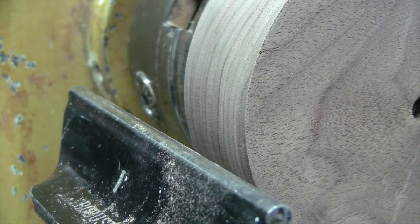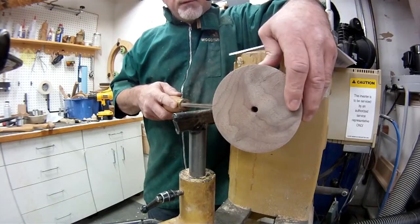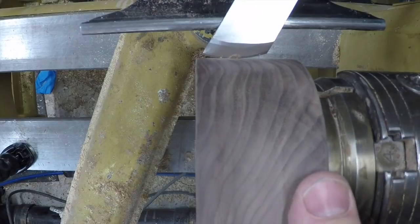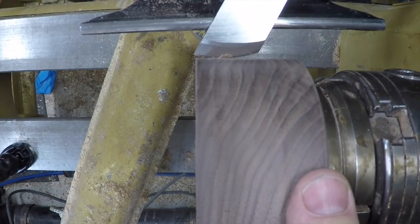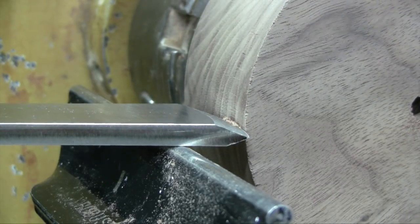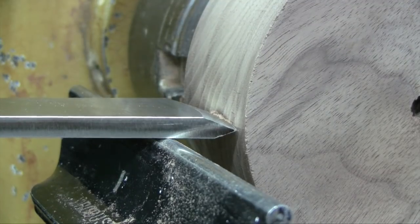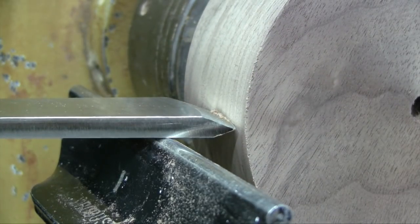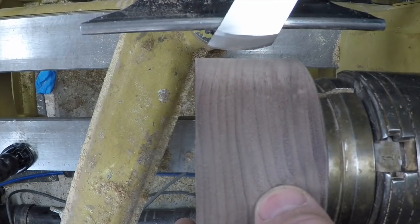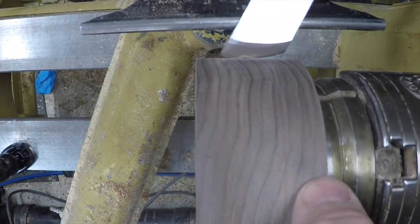Now with a negative rake scraper, for some reason, there's very little energy transferred to the tool. I'm not exactly certain why. I think it has something to do with the negative rake on the top. The direction of the energy being transferred simply doesn't come down on the tool. It may also have to do with the fragile burr, that if you try to get a catch by pushing this in really hard, you'll destroy the burr and dull the tool before you'll get a chance to get a nasty catch. But for whatever reason, there's very little energy transferred to the tool,